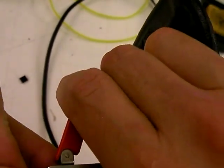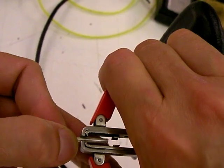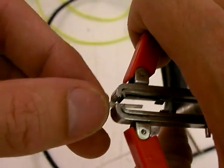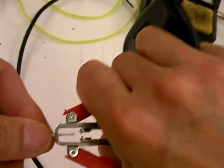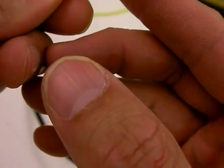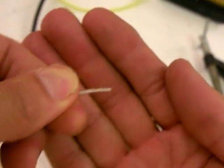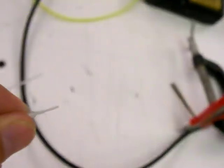A little deeper in this time, just because I don't want to screw it up. It's maybe now at a half inch. Get that off, then do it again right up to where the cut was before, and hit it again. We get one and two wires — perfect, they come out. Two tiny little wires, very fragile. These are used to excite the phosphor core on the inside and drive the illumination of the EL-wire.